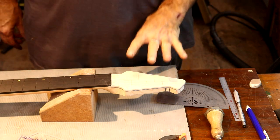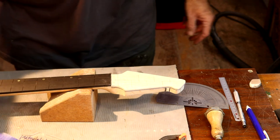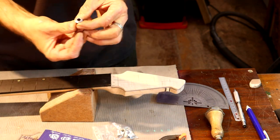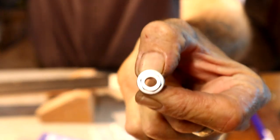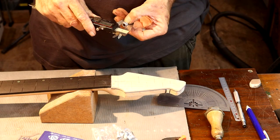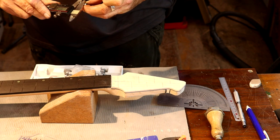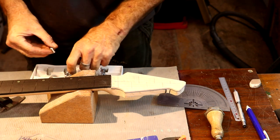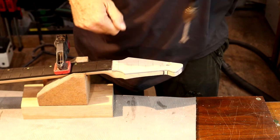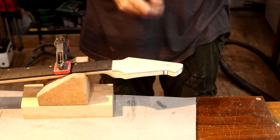What I want to do now is tricky and could spell certain disaster, but we're going to do it anyway. I want to recess these washers and bushings down into the headstock. I need a bit that covers the outside diameter of this washer — 15 millimeters. For depth, we need about 3.39 millimeters; I'll go a 3 millimeter depth. I'm just starting to see my black veneer, so that's how far I'll carry all these down.